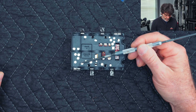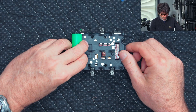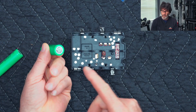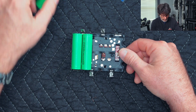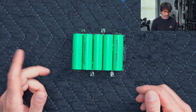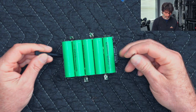If you forget to label the battery polarity, flip it upside down — you can see the plus and minus labels from the factory. Our plus side has the little white circle around the battery end. Start with plus here and alternate every time, winding up with minus on the end. While putting this back together, wrap a wire tie around the whole pack to hold it together so it doesn't get loose.